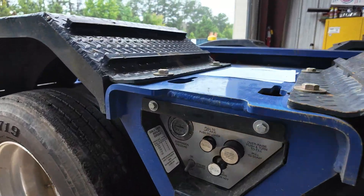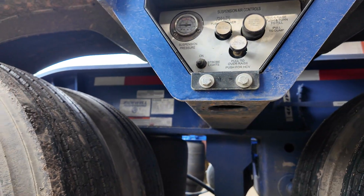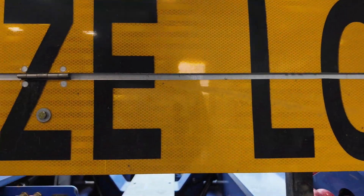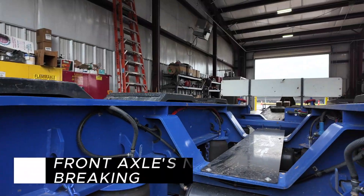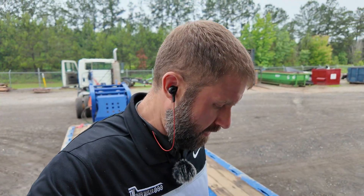I've got to run over to the other side of the shop — we're looking at why the chains are breaking on this other trailer. We got the trailer in, we just dropped the last axle so all three axles are on the ground. Those airbags are very strong and they will pop the chains loose. Let me hop on in the inside. The front axle is not breaking. We've looked at the whole trailer and basically yeah, if those chains are breaking then it's either being operated improperly or going too high or too low in a ditch.